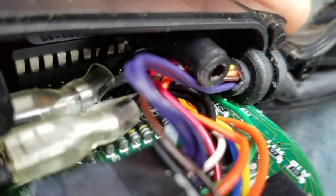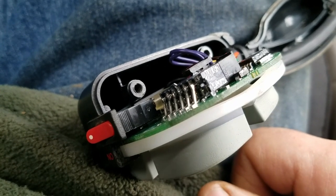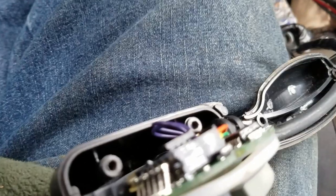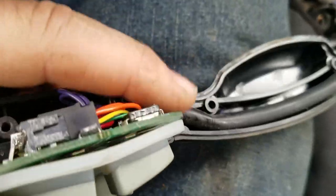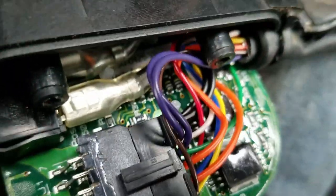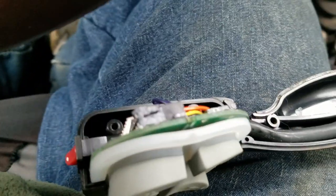I got them pushed through — I put a little dielectric grease on each of them and they went through pretty easy. They have a barb on the end which is meant to pull all the way through and then the barb keeps them mounted or bottomed out. I couldn't quite get it to do that fully and I didn't want to be pulling and yanking in there with needle nose pliers, but they are in position. I slid the left half in and put the strap in with the pin, then slid the right half over top to see what we've got.